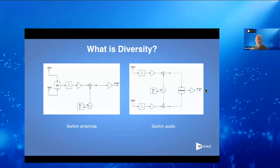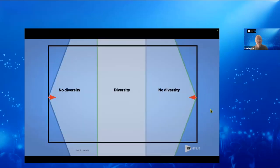So just be aware of that. Sometimes people think, well, all right, now I've got two antennas. Again, if this was my football field or a big room, I'm going to put one antenna on the east wall and point it across the room, and one antenna on the west wall and point it across the room. And you will get coverage in the entire room.